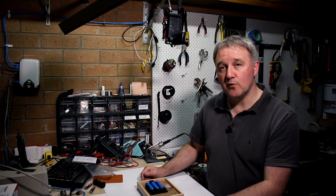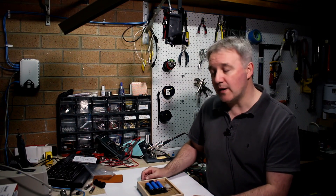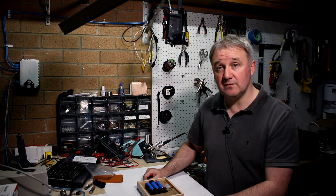When fully charged, these batteries are about 4.2 volts each. When they're virtually flat, they're around the 3 volt mark. So this will run from 9 through to about 12.6 volts, which is nice and convenient for those LEDs.